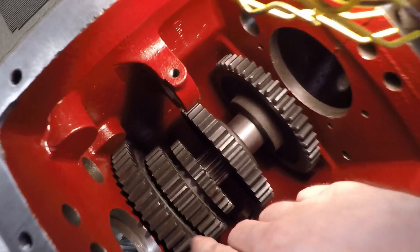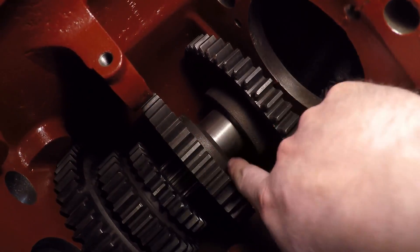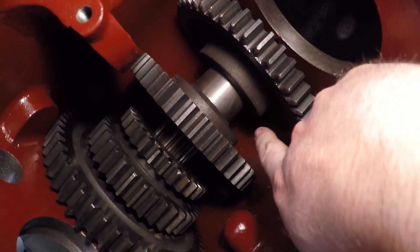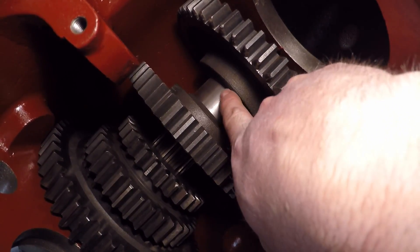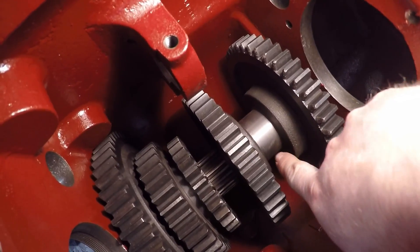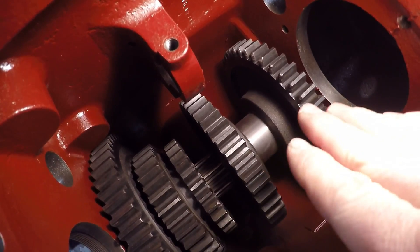Even though the design of those top sliding gear shafts are the same, the installation sequence is quite different. To explain why, we'll go back into the transmission. If you've been watching all the videos in this series, you're aware of the prototype design of this lower gear set that has the steel spacer in between the third gear and second reverse gear, instead of how a production tractor would have a snap ring in front of third and a snap ring behind second and reverse. Note that last video I told you to be mindful of the spacer and how it may cause problems putting this top shaft in.